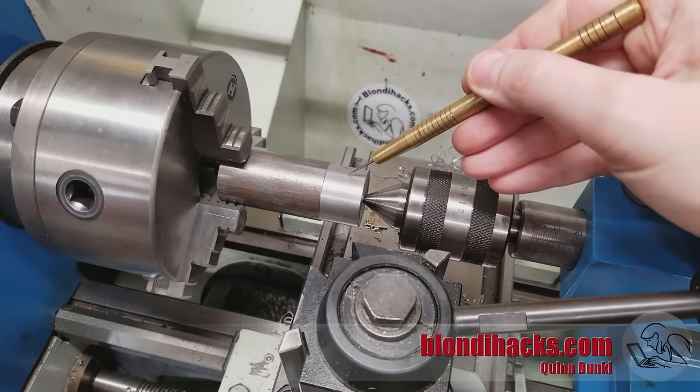Let's see if we can put our learnings to use. I've got a fresh hone on my tool — this is the moderate round-nose tool — I've increased my spindle speed a little bit, slowed down my feed, and we're going to do a finishing pass with some cutting oil on there. Okay, rubbing the debris off — that feels very, very smooth. It passes the fingernail test; I can't feel any marks on that surface at all. It's very, very smooth.